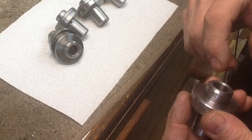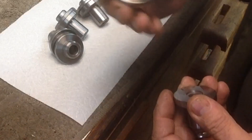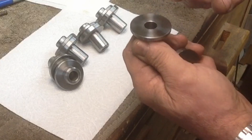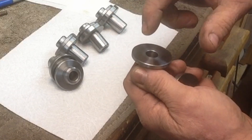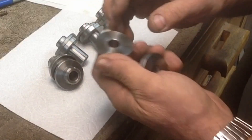These will be drilled quarter-twenty on all of these collars. And while we've got it in that same setup, when we drill those sections, we'll set them up in the middle, index off the center of the bore, and then we'll drill our two holes and countersink them — however we're going to finish them out in both halves.